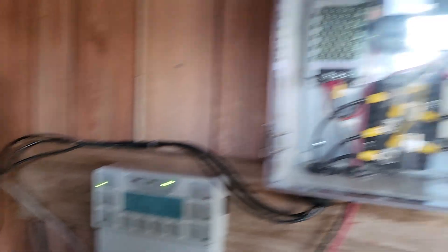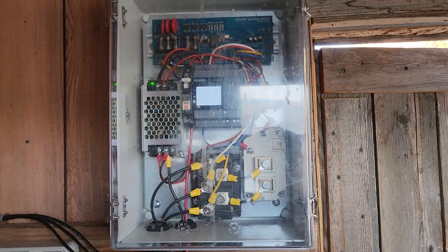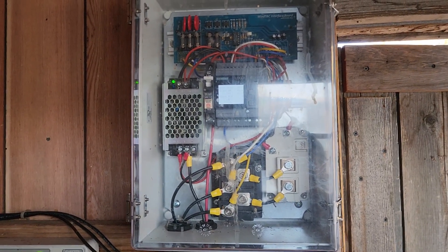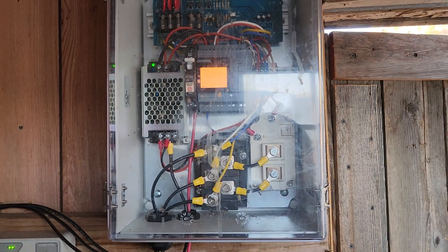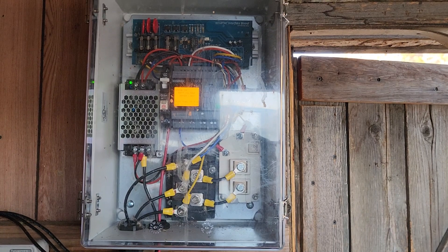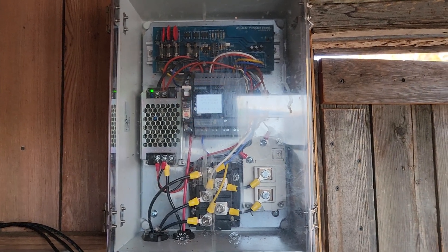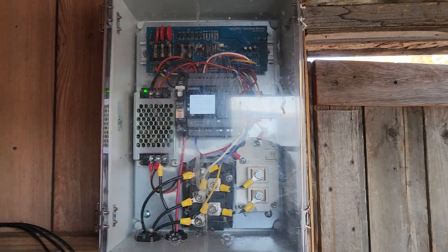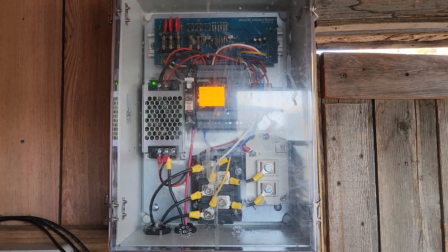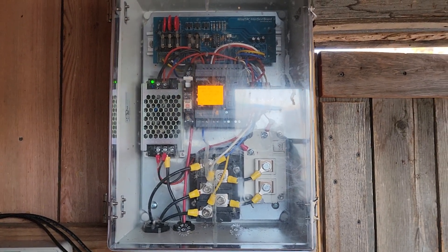The cool thing on this system is this controller here — this is just a PLC. Roy from WindSign built this for us. We call this the WindTac controller. What this does is look at the output from the wind turbine — it looks at three-phase AC coming in. It's flashing now, which means it's shut down. If there's a phase imbalance, meaning a problem with the wind turbine or the line, any difference between the three phases, this shuts the turbine down. If the battery is full at a certain voltage set point, it shuts the turbine down until either a period of time passes or battery voltage comes down to a certain point, at which time it will turn the turbine back on.